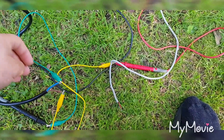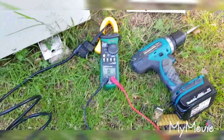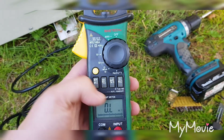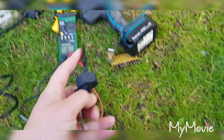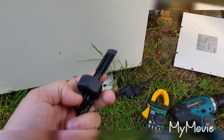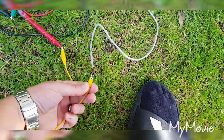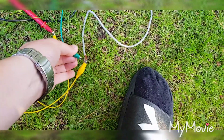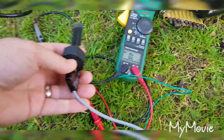The way I discovered that the sensor was faulty is by using a multimeter like this — you need to measure ohms resistance. This sensor is a flow sensor and it will shut off the compressor inside for safety reasons if there's not enough water flowing through from the pump and back again. So I hooked it up with the ohm meter and simulated that the water is flowing through.